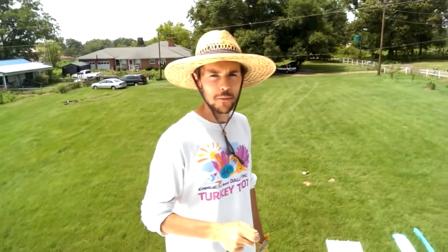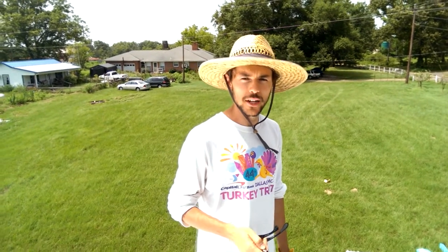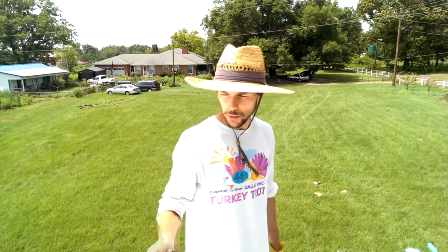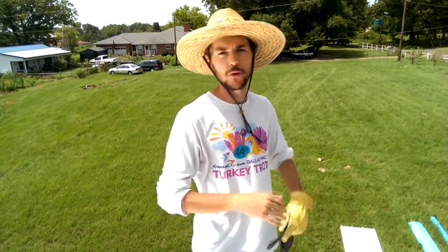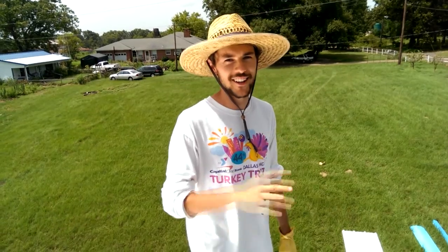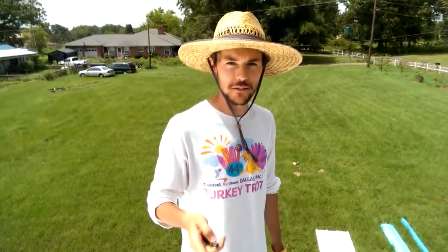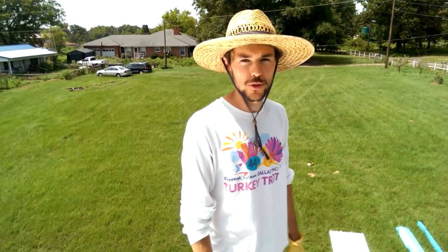Asphalt shingles might be 170 degrees. Paint them white, it suddenly drops to like 120, 130 degrees. Go with white, powder coated steel, and it'll be even lower than that. The idea is to keep the temperature of the roof down, reflecting as much of this hot southern sun as possible. In the north, you want the reverse of that. You want the darkest, hottest roof, the worst SRI value, solar reflective index, solar reflectiveness and solar emittance. So do your research on that.